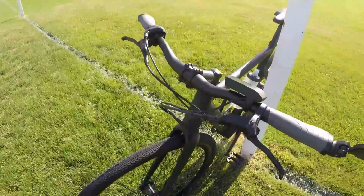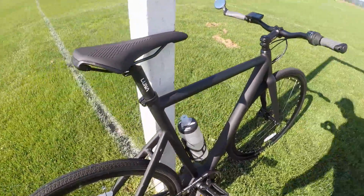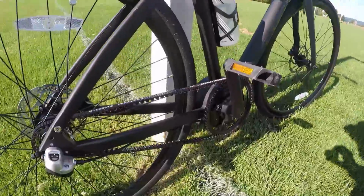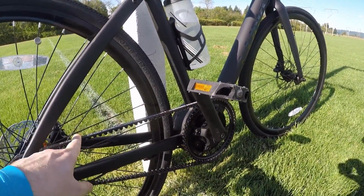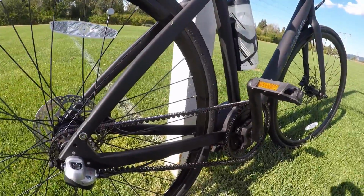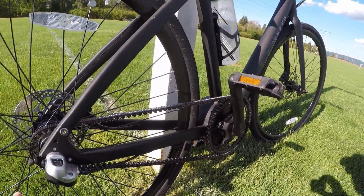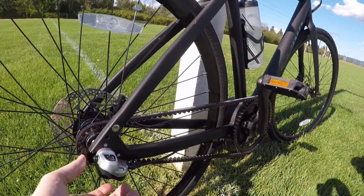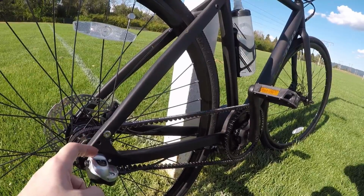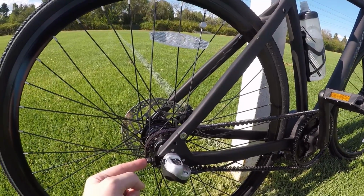And then the last thing out of the box that he did mention, and kind of a cool little learning thing I'll go through with you, he said the belt here was a little bit too tight. Now we have adjusted it a little bit. He said there's quite a lot of friction because the belt was so tight out of the box. So for the adjustment here, basically you remove the IGH head, loosen the wheel bolt, and then make your micro adjustment here. I don't know if you can see that.